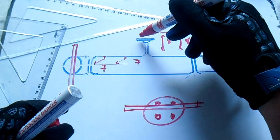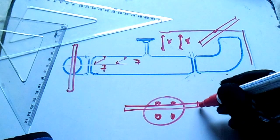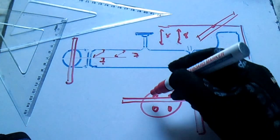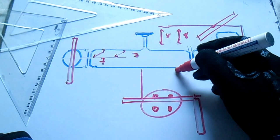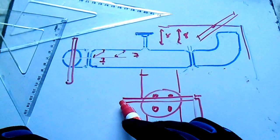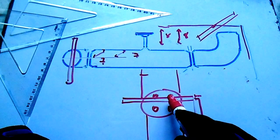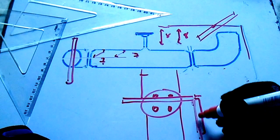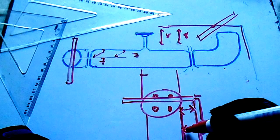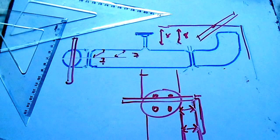You cannot use only your eyes from here — use the right angle. This is a top view. We have our pipe, the main pipe. Place your right angle, check from the edge of the hole — edge by edge of the hole — and also check this alignment from the pipe. If this is okay, your job is in quality.